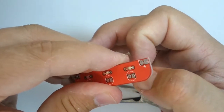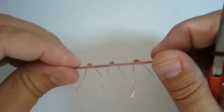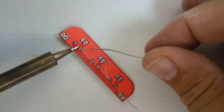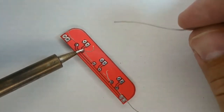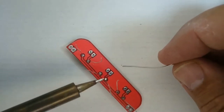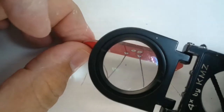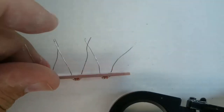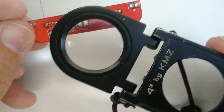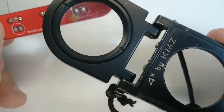Remove the incorrect part and replace it with the correct one. Once you have the 220 ohm current limiting resistors on the board, it is time to solder them in place. Make sure you have an electronics grade soldering iron with a stand and a wet cellulose sponge. Please watch our YouTube video on high quality soldering for electronics if you have not done so already. It is absolutely important that the soldering iron is not too hot and not too cold, and wipe the tip on the sponge every time you pick the iron up. Do not apply the iron unless the tip looks perfectly clean and silvery.